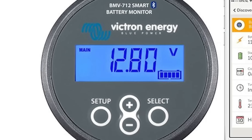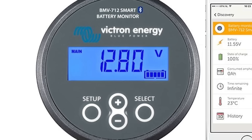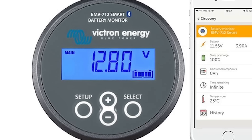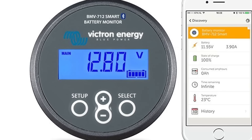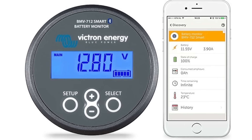This is a very balanced and effective system. It provides for a fridge and freezer and a 2,500-watt inverter that you can use all day, every day. Lady K already has a Victron battery monitor, but if I was to do it again today, I probably wouldn't have bothered with the screen. I love it because it lets me see every draw, what's going in and out of the batteries at all times. But in my most recent build, I found I no longer use the little screen — the Victron app for your phone and tablet is so much better. I found myself looking at the screen once in a while and needing more information, so I'd open the app anyway. It's much cheaper to just buy the Bluetooth shunt and get the app on your phone.